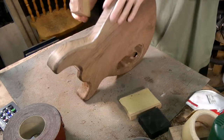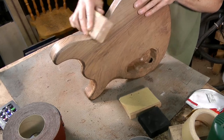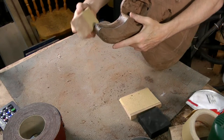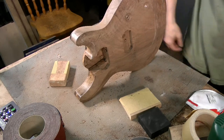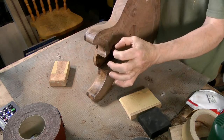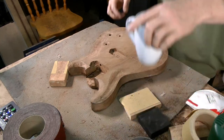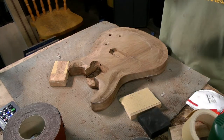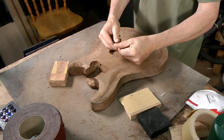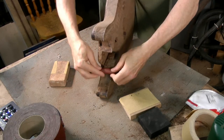So we do the same on the other side. Now I'm not going to completely go until this is perfect because it could take hours. I'm just going to demonstrate, okay? And again, this is an internal corner in there. And these are really tricky. So you might want to get something smaller, like a broomstick. I use a broomstick with sandpaper wrapped around, or a length of a broomstick. Something small and round, a big fat pen or anything like that. Carol will throw me a big fat pen in a minute. Thank you. So if you haven't got the self-adhesive, you just wrap it round like this, nice and tight. And then away you go.